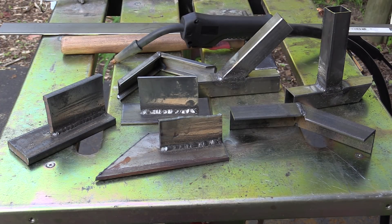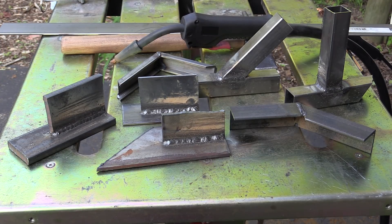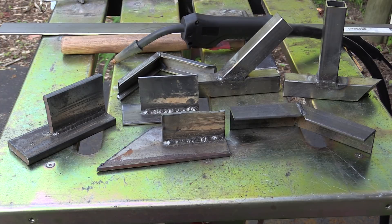The welds might not be the most professional looking, but it didn't do too bad. I'll get a few more duplicate joints welded up so we have a few different things to cut and etch, and we'll see what kind of penetration results we're getting on this material. One more note — I did have the machine basically maxed out most of the time. I'm using the included wire, which is .035 diameter.